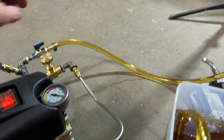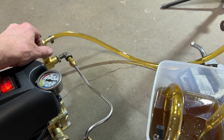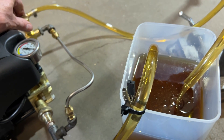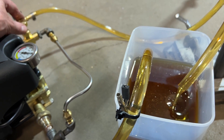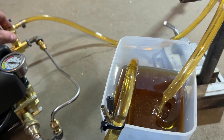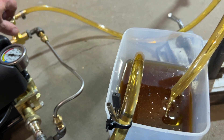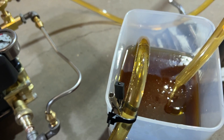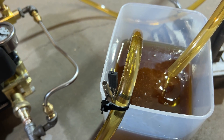If you want to adjust the flow rate, we can close this valve. But before we do that, we want to open the bypass. I'm going to go ahead and open this bypass valve. I'm going to just open the bypass all the way here. I'm going to close the bypass valve quite a bit.